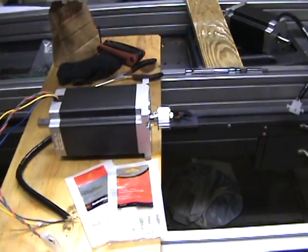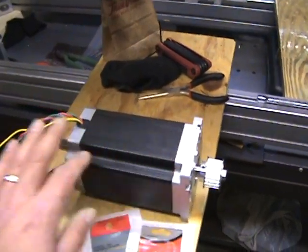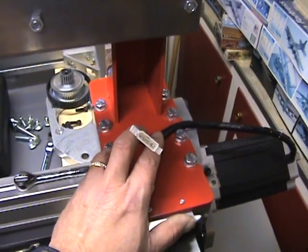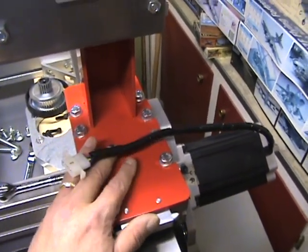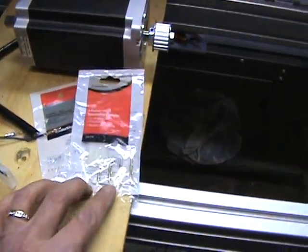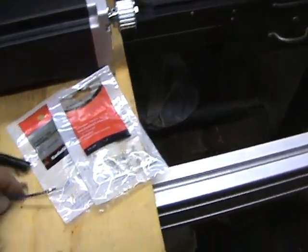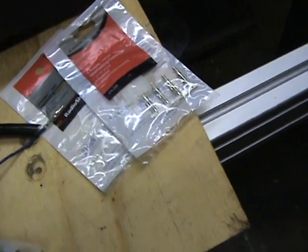Since I had to do all the disassembly anyway, I went ahead and started doing the wires for the end connectors. I've already done my two X-axes and my Z, and I'm working on the Y right now. I have a four-pin cable end connector — got them at Radio Shack, you can buy both males and females. You get your pins, break them off a tang, crimp them onto the wire ends, then press-fit them into the adapters. After crimping, I put a little bead of solder in to make sure they're solid.